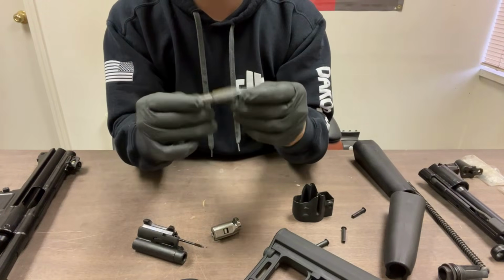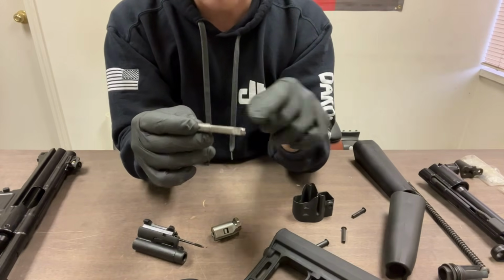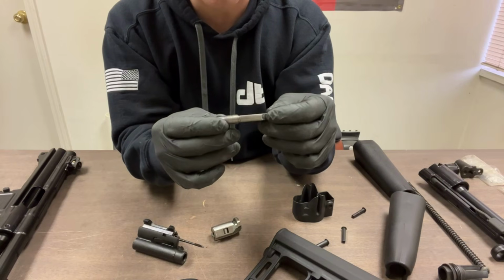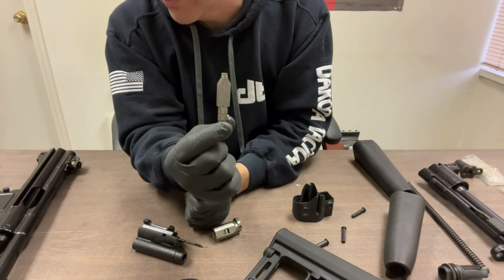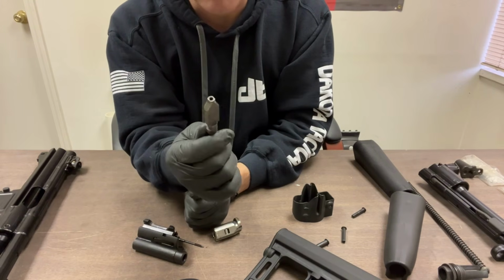German locking pieces are of a much higher fit and finish quality, and they are marked with a number designation which translates to a specific degree. So it's unknown what degree is in this gun. And the HK53 has 3 different locking pieces based on ammo type and ammo pressure. So we have no idea what it comes with.